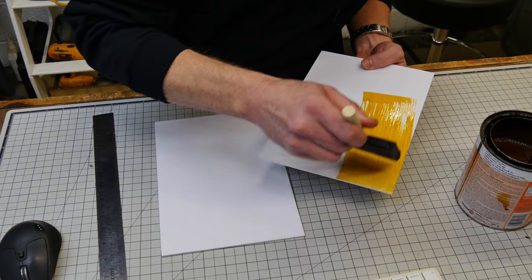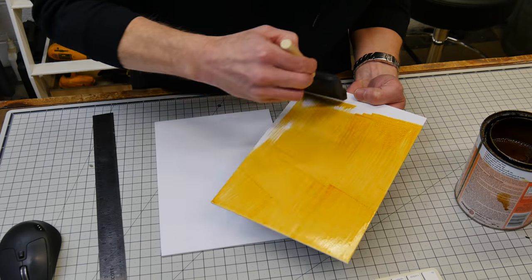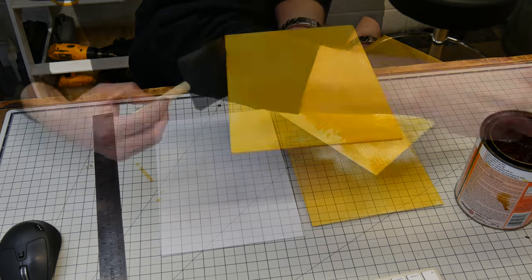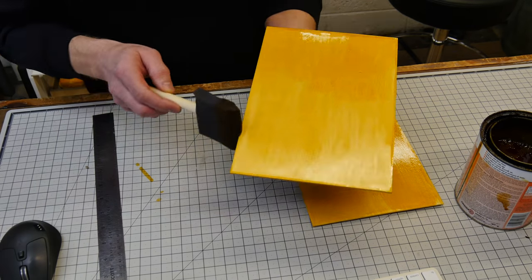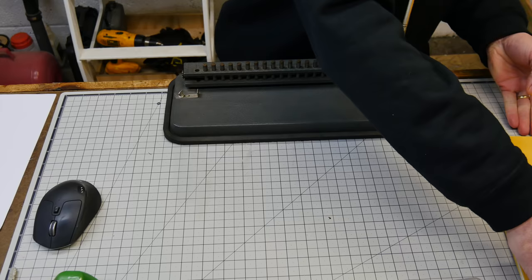Because we're going to be putting acrylic on top of this material later on, I'm going to seal up the covers with some shellac. And so thus it's yellow here. I'm using a foam brush, and I'm coating the front and all the edges to try to seal everything the best I can to prevent warping of the covers when we do the acrylic pour.